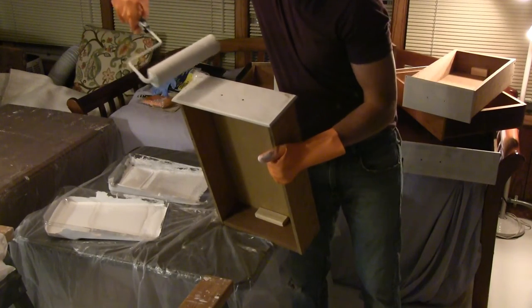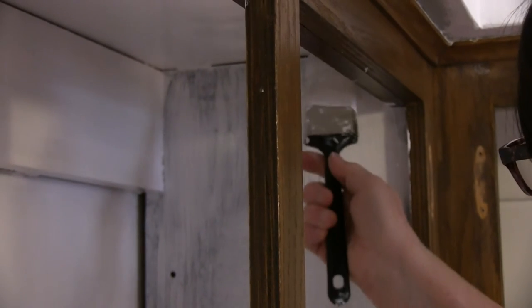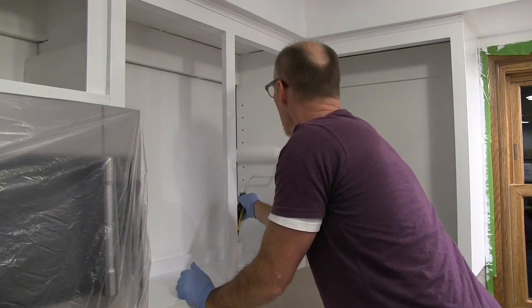Number six: give yourself more than a weekend to do this project. We would put a coat of primer on and wait until the next day for the second coat, even though primer dries in an hour — we wanted things to harden. After one coat of paint on everything, you're going to want a break. Don't rush it; get it right, be meticulous, and keep your marriage intact. We split the work: one person on drawer faces and cabinet doors, while the other painted the insides of the cabinets.